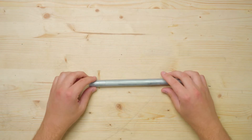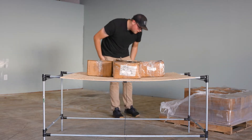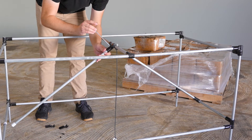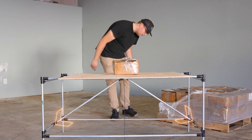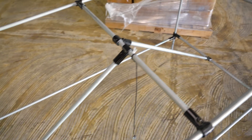Half-inch EMT conduit, as you might suspect, is the weakest of the three conduit sizes. I started noticing some flex from the pipes after two boxes, and somewhere between three and four boxes is the absolute max I would trust the frame to hold — that's somewhere between 90 and 120 pounds. Next, I used a simple bracing method to add support to the frame. I added two pipes from the center crossbar that went down to each of the sides. This design sends the weight down to the sides before it allows the top horizontal pipes to bend. I love this method because it's really simple, only requires a few extra pipes, and allows for longer spans of conduit that can hold more weight.